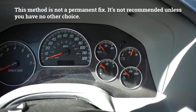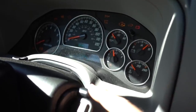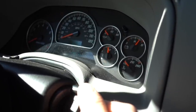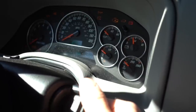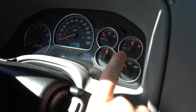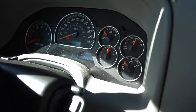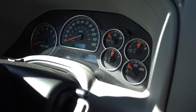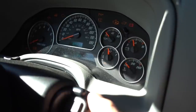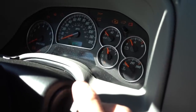So as you turn that key the gauges attempt to reset themselves. This voltmeter seems to be stuck in entirely the wrong position. Now if I take this key and turn it to the run position — just before I go to actually start it — I'm just going to turn it a fraction of an inch. You can see the gauges tried to reset themselves. I'll do it again and again. You can see this is a very very slow process but it does reset the gauges ever so slowly. You might have to do this quite a bit to get that gauge to reset fully.